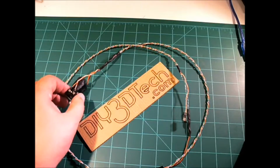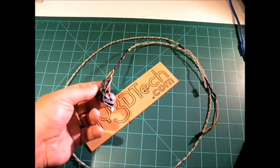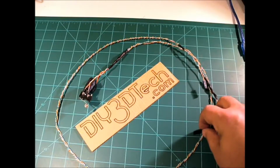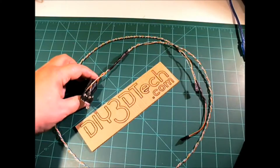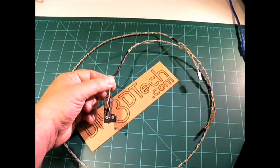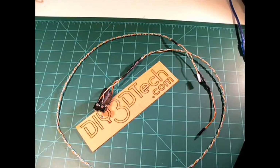In this episode, it's going to be a bit of a multi-part episode. What we're doing is we're finally installing the auto leveling function on the TwoUp. As you probably remember from some previous videos, I meshed up a head for the Bowden extruder, and on it was the ability to place an auto leveling servo and switch. So we got that in, we got that built, and again, before I install it, I wanted to show you some close-ups of how this is going to go together.